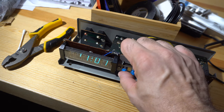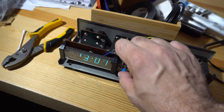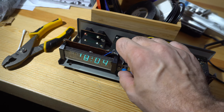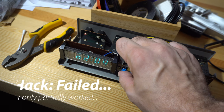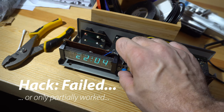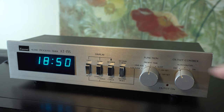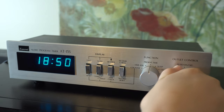Instead of lighting up the AM and PM indicators, it's lighting up some other piece of that digit. So I think the chip handles it, but it's not wired into the display correctly. And to get into this would require taking that clock off, which is about 40 pins. So I'm just putting it all back together and being satisfied with the 24-hour clock mode for now. At least we tried to hack it, but that's about it. See you next time for another video.